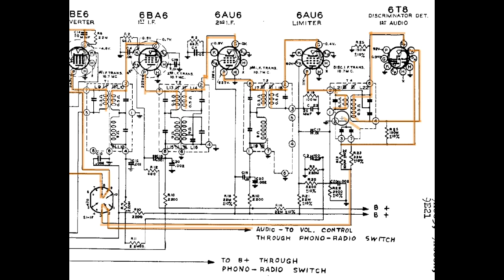So this whole business here is used to clean up the last of the FM. Remember, the FM has been converted to AM right here in this circuit. It's actually all of this circuit. The FM is converted to AM, then it comes over here, gets its high frequency stuff stripped out, nothing but audio at this point, and on out the other end of the pipe. So that's it. That's the signal flow. This is not a complete schematic, as you can tell, but the rest of it is as generic as beans.